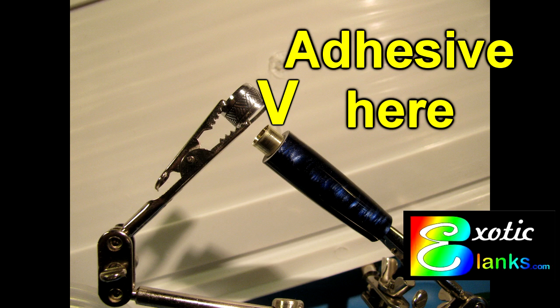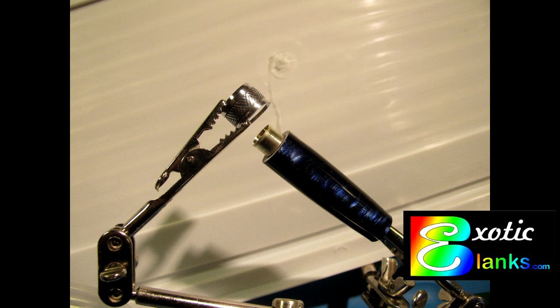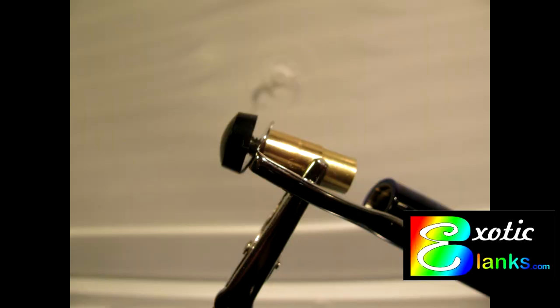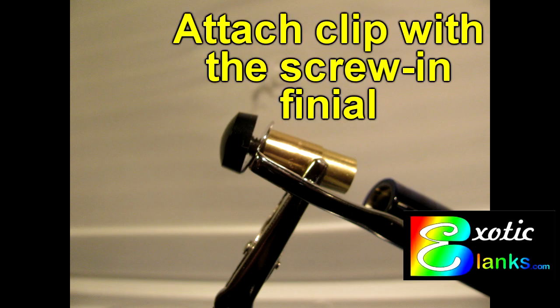So if you put the adhesive on the brass and then put that center band in place, you may want to turn it right side up, because that may give you a better chance of getting that ring in right. Make sure that once you've got that in place, you put pressure on it and hold the pressure on it for a little while so it doesn't fall apart when you take the pressure off.